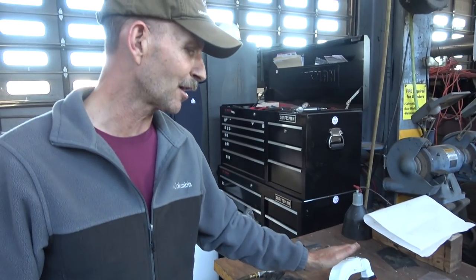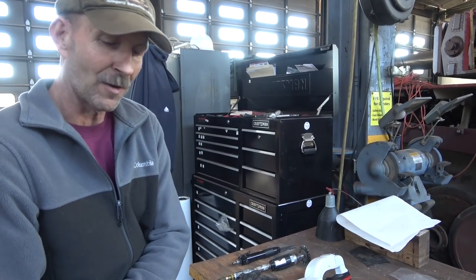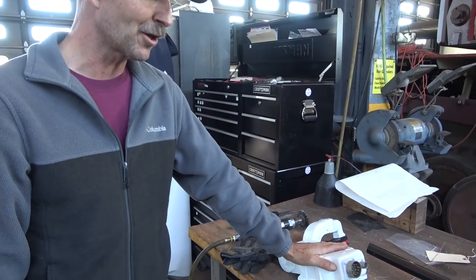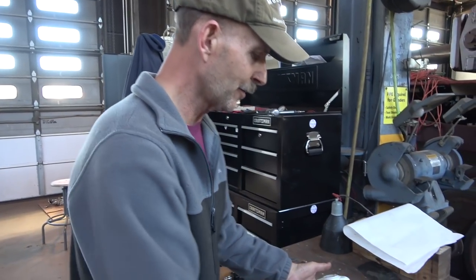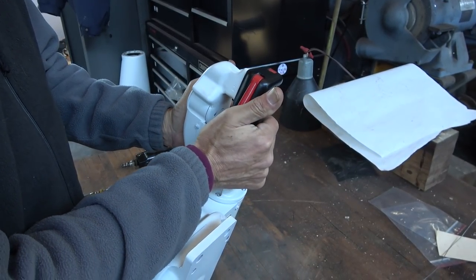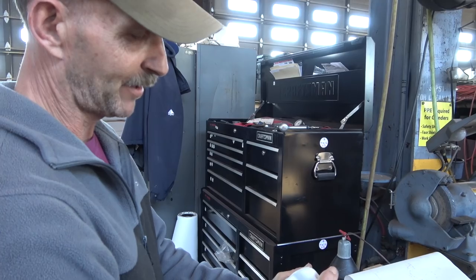This is the Tank Commander's Override — or what I call the Tank Commander's Power Control Handle. This is the piece the commander uses to control the turret; he can control both azimuth and elevation. This piece actually sits right there by his right hand, so he just rests his arm on it and moves the turret as he sees fit. This was one of those pieces where in reality it looked like it wasn't in too bad shape, but once I got into it, that's about a week and a half worth of work right there. You have the handle, the palm switch which engages the hydraulics, and the trigger. These both move now and you can actually hear them click with a little micro switch inside. That was one big chunk of rust — it would not move, it was frozen up. But now it's got some pretty good movement to it.